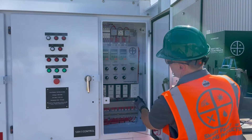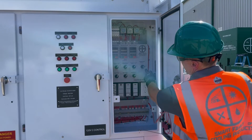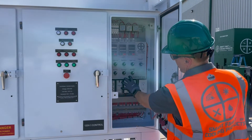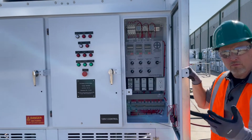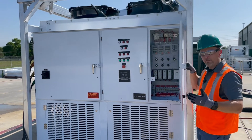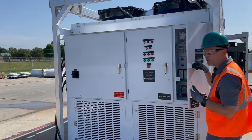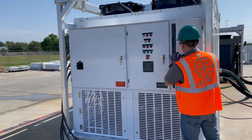Your compressor on/off switches are right here. And then your cooling probe selections — you can actually run off of leaving fluid or return fluid. And here's your C450 controller, which is the heart of what controls the compressors. We're not going to talk about how to change set points on that controller during this video; however, there is a great video that Brett did on our YouTube channel. Search for Smart Family Cooling Products on YouTube and look up C450 to find the temperature adjustment video.